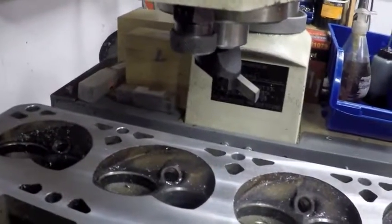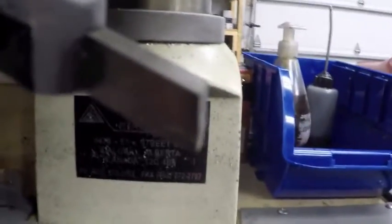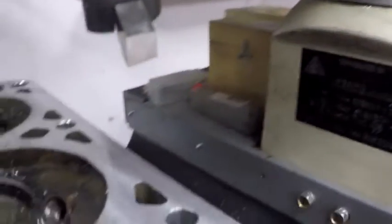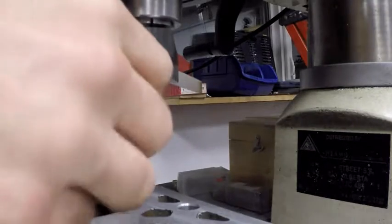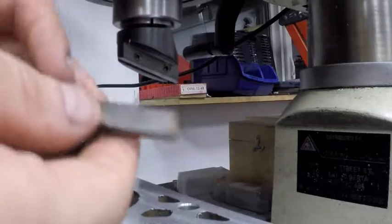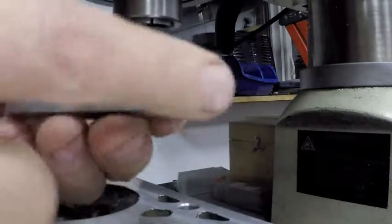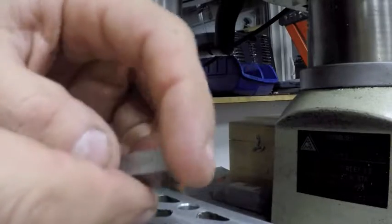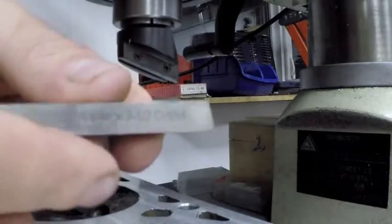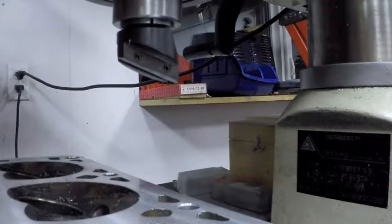In the next few days I may be able to try to put a new surface on this head. I'll just take it out of the cutter and show you guys the basic shape of it. I still have to touch it up a little bit on the honing stone. This is the cutting face — there's the clearance angle cut on the bottom and there's the clearance angle cut on the face. I believe it should do quite a good job.